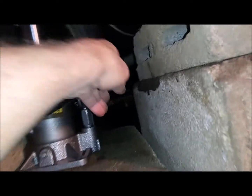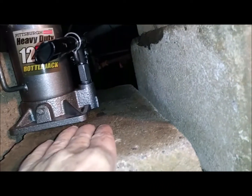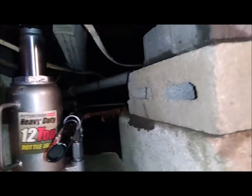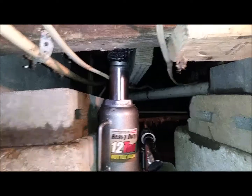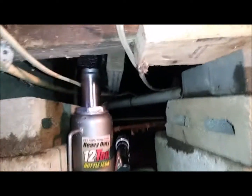It's really easy — the whole floor is moving upward, you see that. My problem is I've got to find something to support it on that end so I can use this pier for both the front and the back, because I'm raising this girder as well as the joist and the joist back there. It's a meeting of two joists that gave way, that's why it's such a pain. Good news is it's off the pipe and off the wires — so we're doing well.